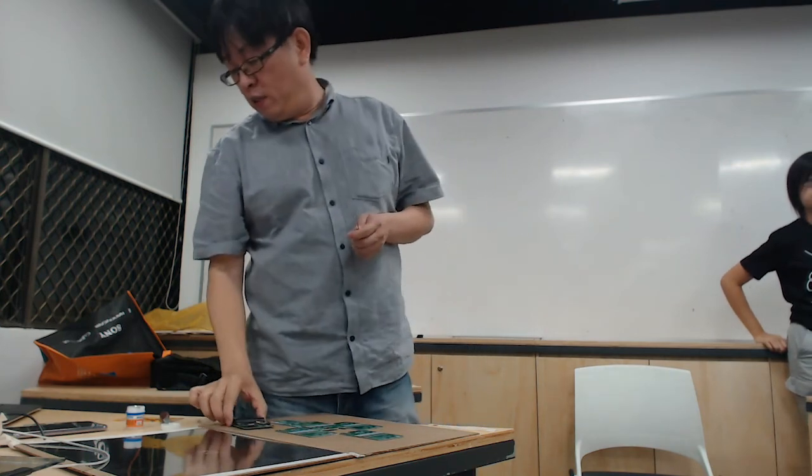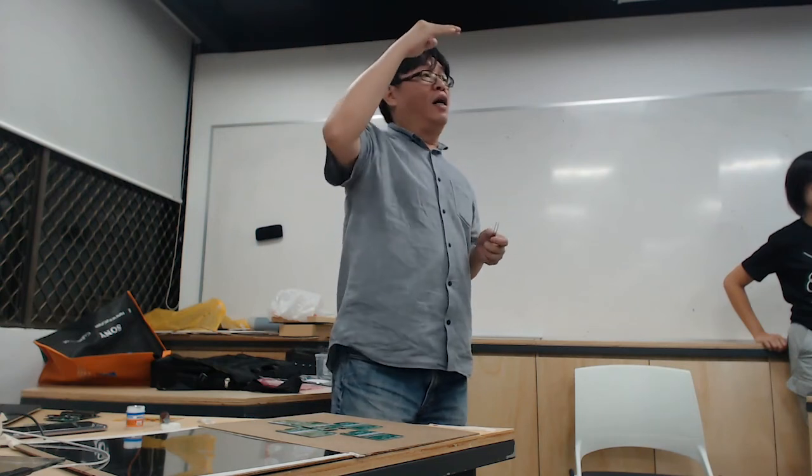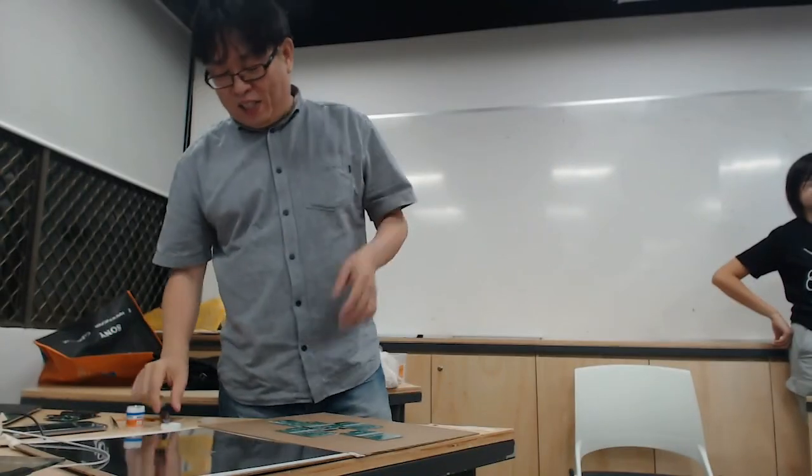Yeah. So that's my learning process. I'm not an expert in this. I'm just trying out. I don't mind burning a few boards. On the internet, there's a lot of people that use large toaster ovens, and they always scorch the board because it's very hard to control the temperature in a bigger volume. This is just 8 liters. I got the smallest one that I can, because I'm cheapo also lah. Okay, and that's it.